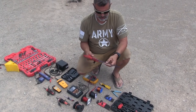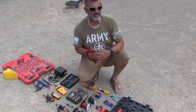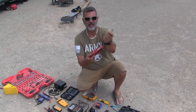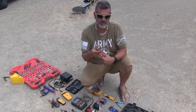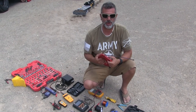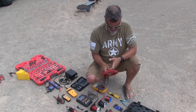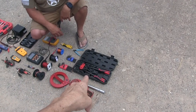Oh, we forgot this — it's a fish tape or cable snake. You pull out this flexible flat metal tape, fish it through a small area to another opening you're trying to get wire through, hook wires to the little hole at the end, then pull it back to bring the wires through. In the bus, after we had installed things and needed to run wire again through areas we couldn't possibly reach, this is what we used. It was awesome for that.